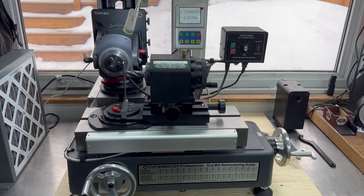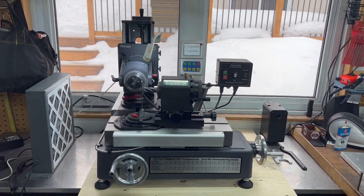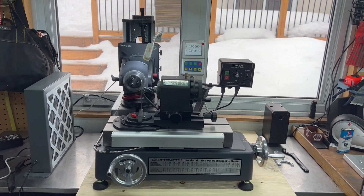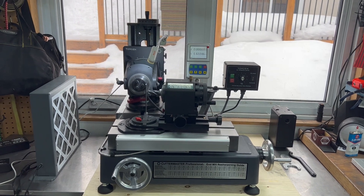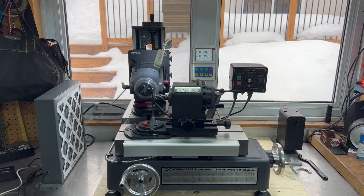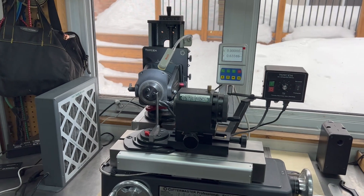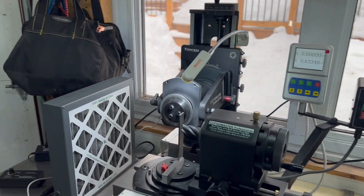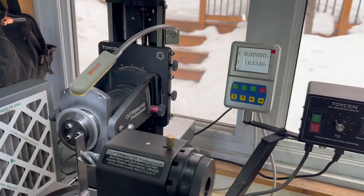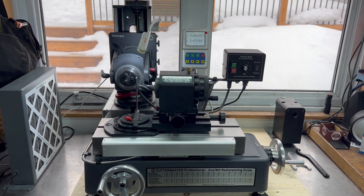The Journeyman JXT is basically the modern version of our original Journeyman. It has a 77-millimeter DC motor running on 130 volts — very powerful, with the same torque as the 50-pound 56C-face 300-watt AC motor that used to be on there. Having a smaller motor with the same torque allowed us to make a more sophisticated, easily positioned mount that is height adjustable, allowing you to do a really good job on ends.